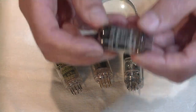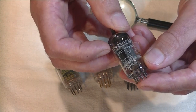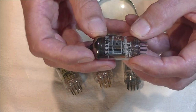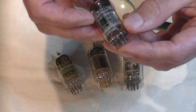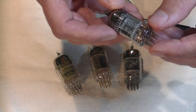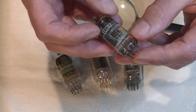Just because a Mullard doesn't have a clear acid-etched date code does not mean that it's not a real Mullard — it can also mean that you're dealing with a fake. In this case, I have other Mullards. I was able to compare the plate structure, the wiring below, the way the glass is molded, and I know for a fact that this is a real Mullard. One of the giveaways with Mullards is that when you turn these on, there's something called a heater flash or a filament flash. If you haven't seen one, it's exciting at first — you think you've bought a piece of junk. But no, this is brilliant. If you see that flash, that's a really good indicator that you've got a vintage European tube. Mullard's not the only one that likes to flash, but they flash pretty consistently and bright, and it's not a defect of the tube. It's just how the filament was connected up to the pin — they scrape back some of the coating. In later production tubes, that coating is reinstated after the connection is made. Mullard did not do that, and as a result you get this flash.